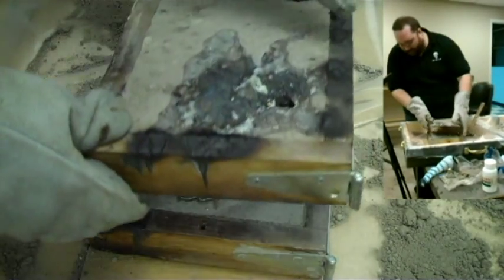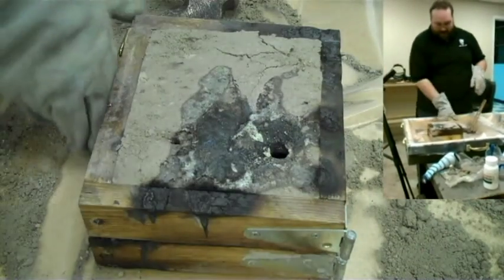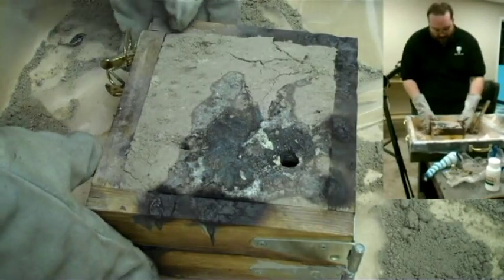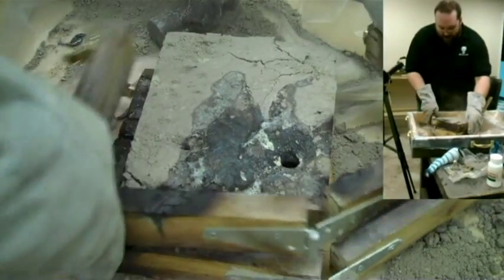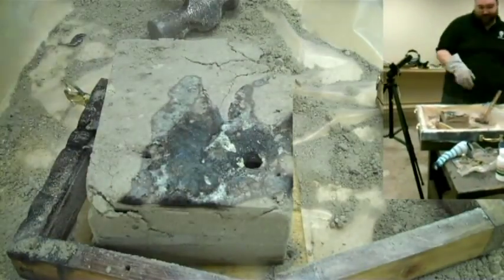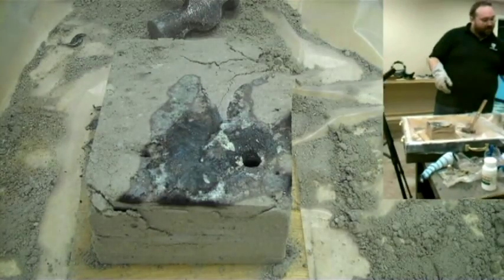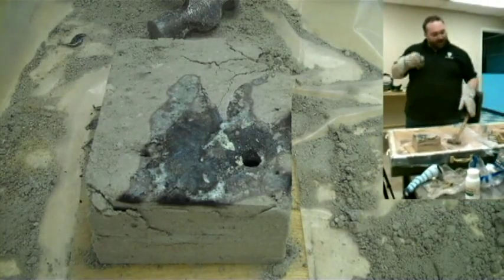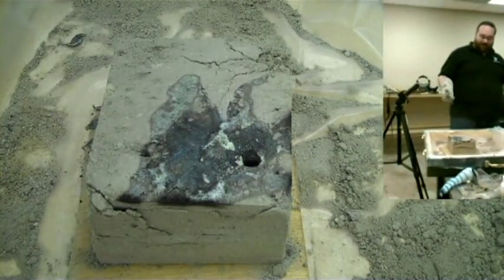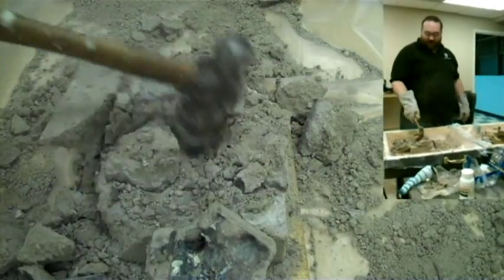If I had assembled it the right way, I would have simply been able to unsnap the hinges, pull the frames away, and cast into the sand like this — and I would not have damaged my frames anymore. You can let this sit for a while, or you can go at it with a hammer. It will be extremely hot, obviously, for a long time.